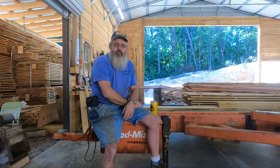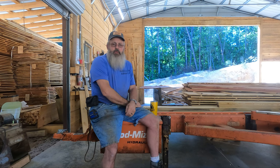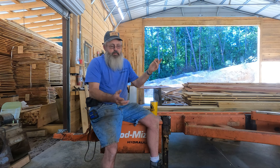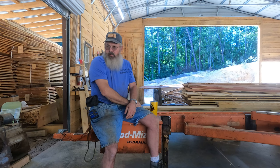Okay guys, if you're still here, we greatly appreciate it. If you got this far in the video, you've seen where we were sawing along, getting ready to change the blade and run into some difficulty. Had one of our bearing carriers had gotten loose and greased over, it was flopping. So sometimes it's an easy fix. In today's case, it wasn't. We had to go through and realign the mill, get everything set back up. It's not a horrible process, but it does take a little bit of time.